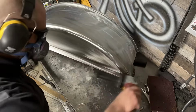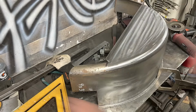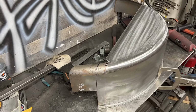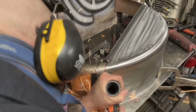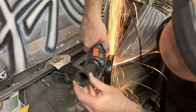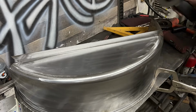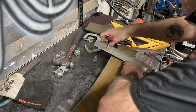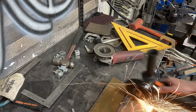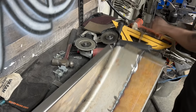The side plate was made to make the fender the proper height. I'm going to use it to mark the fenders so I can trim off the excess. I'm leaving an extra inch here too, so I can make yet another flare. All these flares will allow me to spot weld this wheel tub to the bed, floor, and walls on all sides. The corners can't be bent, so I'll just remove those. Just like the sheet metal in the bulkhead in the previous video, I bend thick sheet metal by first scoring the metal with a cutoff wheel and then bending it by hand with some hand seamers.